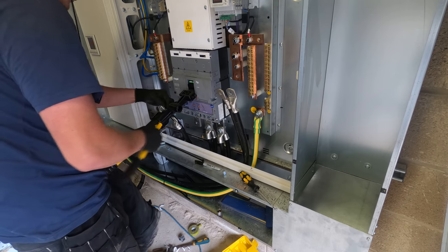But yeah, so in this panel, I connected up the supply to the steelworks wrong. So on the left hand side it's L1, L2, L3 top to bottom. On the right hand side it's backwards, it's L1, L2, L3 from the bottom to the top. And in my haste, messing around, some of you might have noticed it. So yeah, if you're in the comments giving me a hard time, you might have noticed it. Or in the last video, yeah.